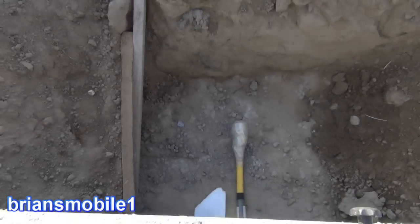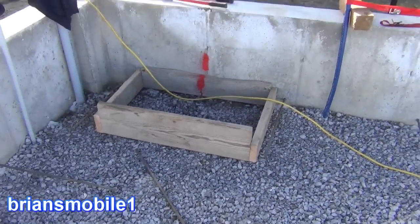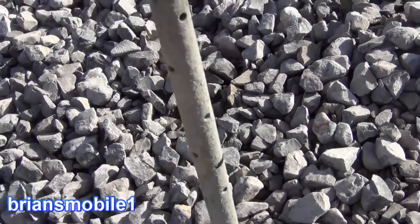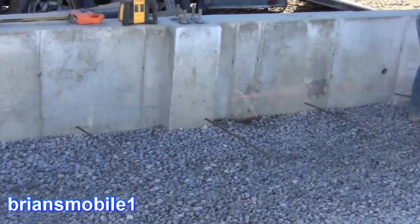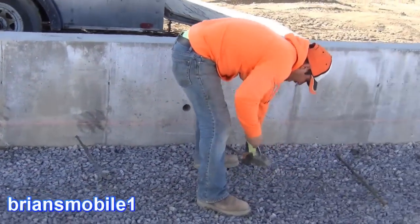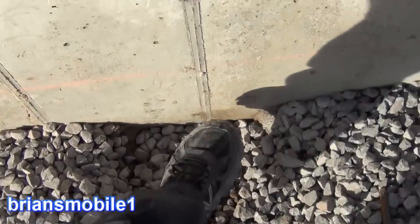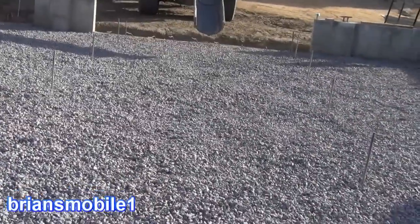We've got the lines all marked out, we've got a five-and-a-quarter plus whatever variance in the gravel. No high spots. We've got a gas line sticking up — it says don't bury beyond this, and we're right about there. We'll tie into that later. We've got a box in for the drain — you've got water, you've got to have a place for it to go. They've got stakes in the middle with sharpie marks just to show how deep to go. You've got rebar kind of in the middle — just drill it and pound it.